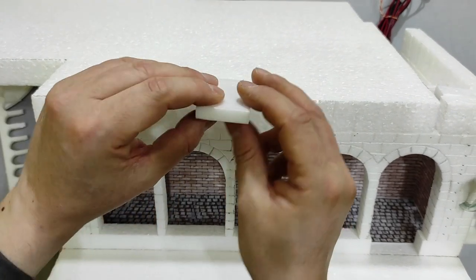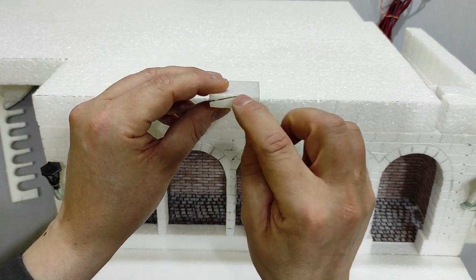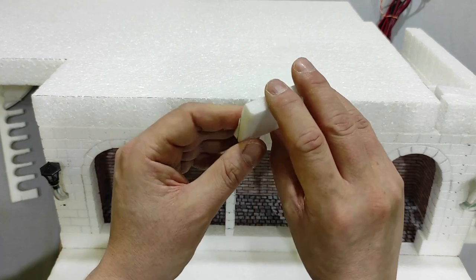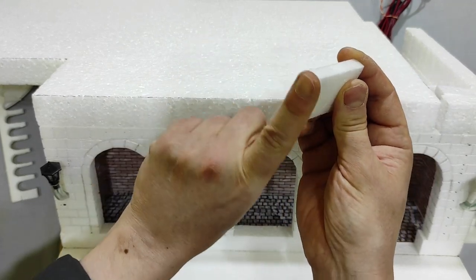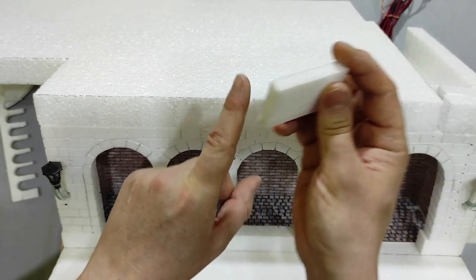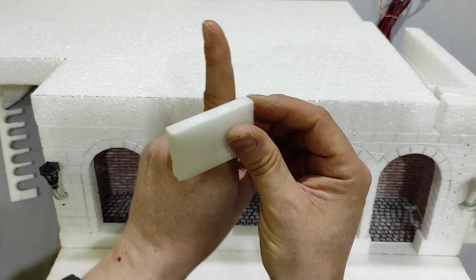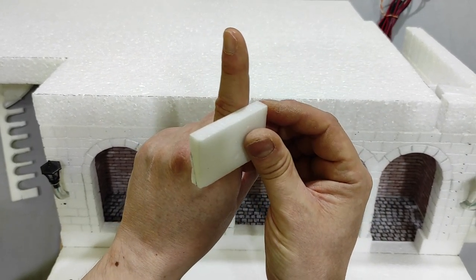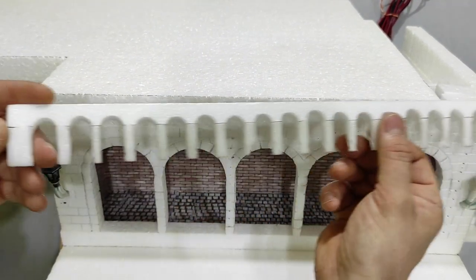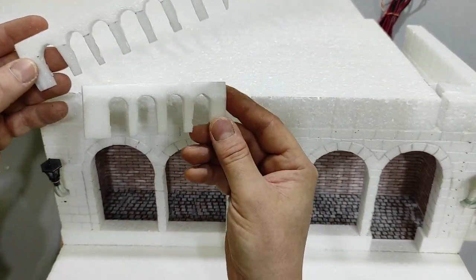And then I've used the inclination of my styrofoam cutting table to cut this slope there. So I placed it vertically. Then the wire was not vertical but was bended by 15 degrees there. And then I've slided the vertical piece of styrofoam against the inclined hot wire there. And I've obtained this piece there. And the same technique I've used for the small pieces, more parts there, okay?